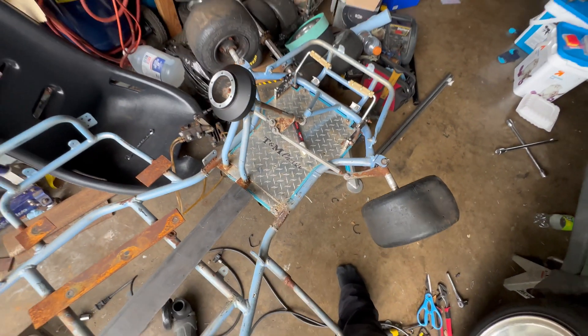We got the steering welded in, in a nice spot. I think I'm going to buy an extender that comes off here — maybe a couple of inches — so the wheel sits up a little further and my knees get more clearance. For the angle though, I think it's the best I could do. Everything is just tacked down, so I still got to weld it fully around. But this is looking really good. With the new tie rods, the steering is straight now. Hopefully everything works out without steering bind. I still gotta get the brakes done after welding this together. I went ahead and welded the handbrake bracket. We have working brakes now — I think I still need to bleed it a little because I see some air bubbles, but we have a functioning brake.